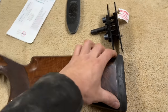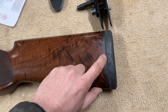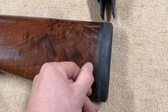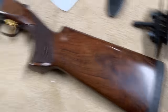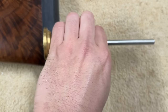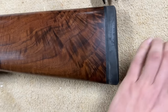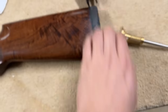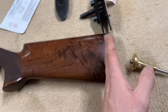When I've had to cut a gun stock down in the past, which I've not got to do on this one, I've marked how much I want to cut off it, say 10 mil or so, and I've gone round with my little wheel gauge that cuts the grain. So you just set it to the depth, run my arm with that, cut it to the grain. Then I go on the crosscut saw and I set this cut up, like I pull the blade out and just butt the cut that's already there up against the saw blade.